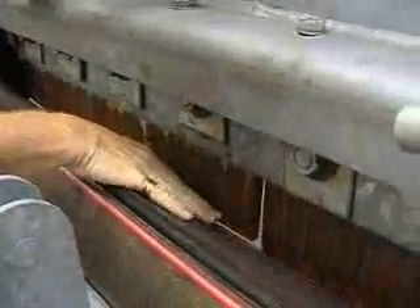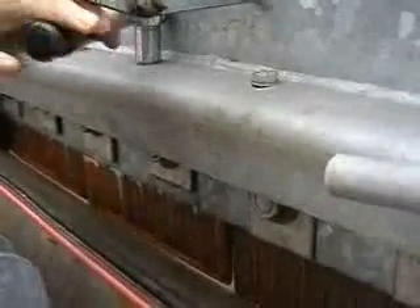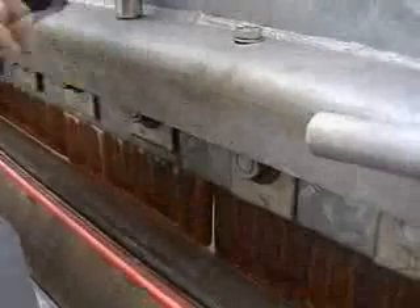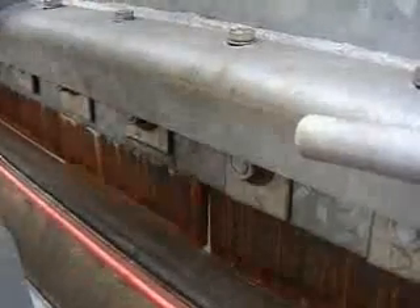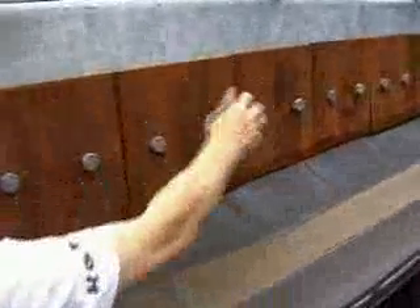You can see the gap that's already existing between this liner and that liner. All that I'm going to do is just turn this ratchet. We'll start with this one. As you can see, that liner is lowered. Now we go to this side and we lower this side. As you can see, now all these three liners are about the same height. You'd normally get the right height with a welding rod stuck between them as you load them. Now that we've lowered that one down, they're all now flush.